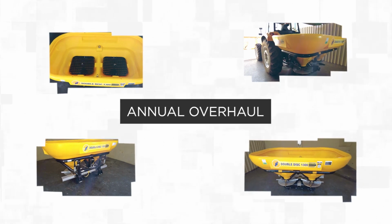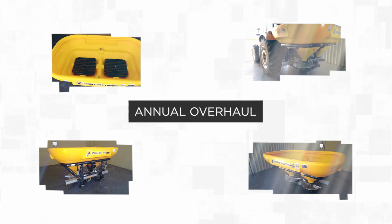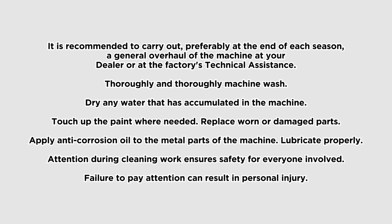Annual overhaul. It is recommended to carry out, preferably at the end of each season, a general overhaul of the machine at your dealer or at the factory's technical assistance. Thoroughly wash the machine. Dry any water that has accumulated in the machine. Touch up the paint where needed.